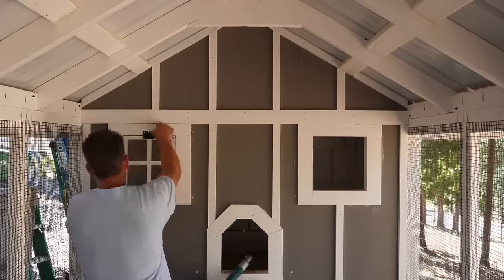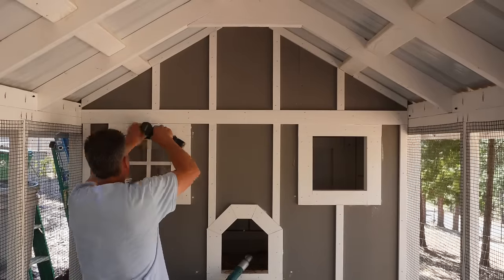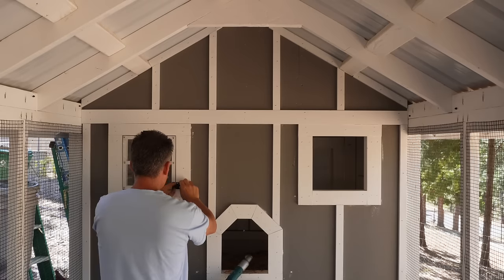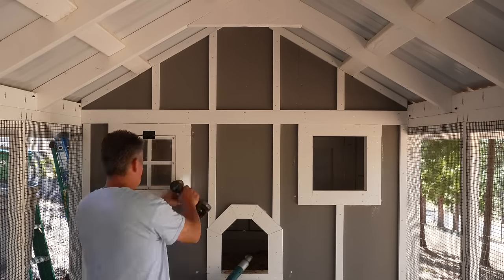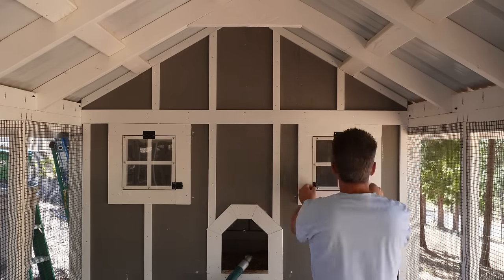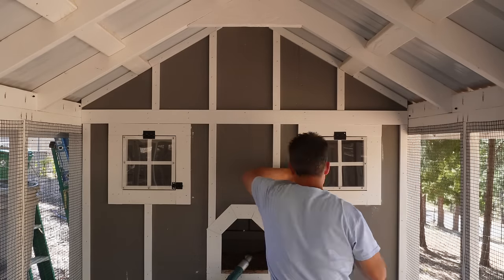If you look on the walls, there's a bunch of holidays, the white paint there. And then there's a bunch of nail staple holes on all the trim that I have there. And later on in the project, I came back and filled all those, did some caulking and touch up, and it's no longer there.